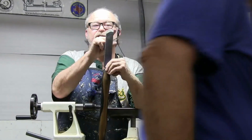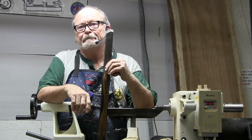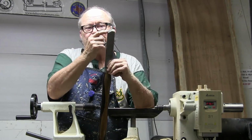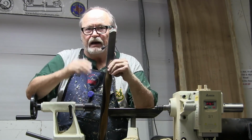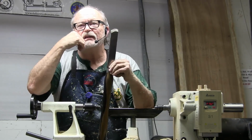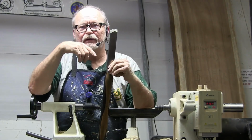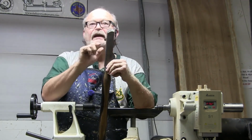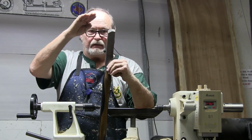You got it. It's 70 degrees from point to point. It's still 70 degrees. Don't lose that. If you pull this around too far, you can't find it. If you don't have it far enough, it's trailing too close to the wood, and you'll get more runbacks and dig-ins. So the 70 degrees is still operative, even though it's a curve. It's straight and then a curve.